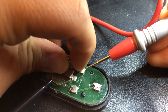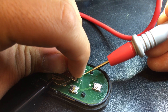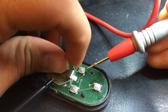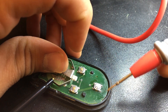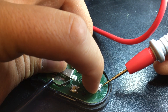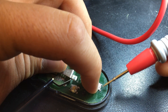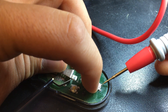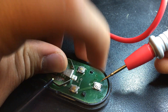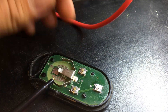This is ground there. This is hot. When I press the switch, we get continuity. The casing is not shorted to ground, so that's good. Here the casing is not shorted, and it's not supposed to be that way. That's a rather bad solder joint there, but so be it — it works. That's ground, and this is the hot. Test this corner too. So it's good.